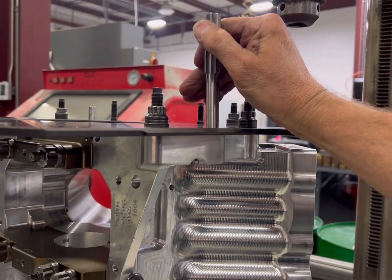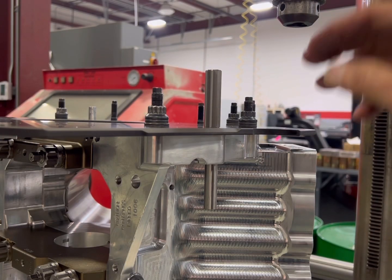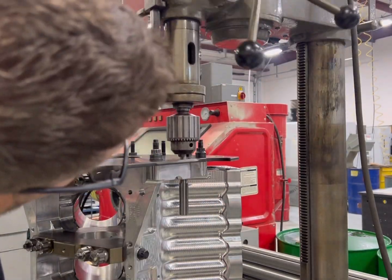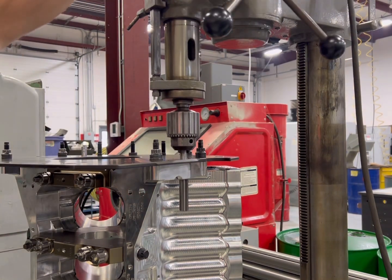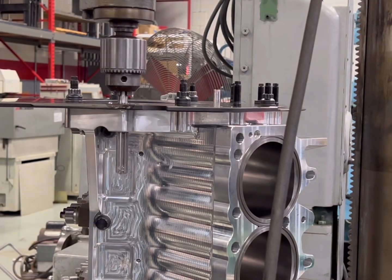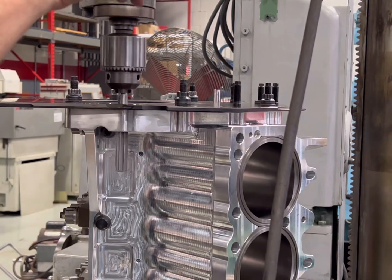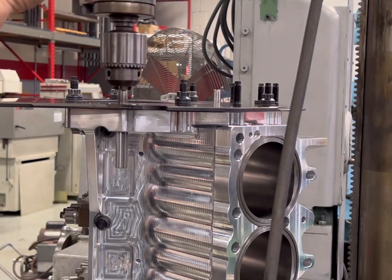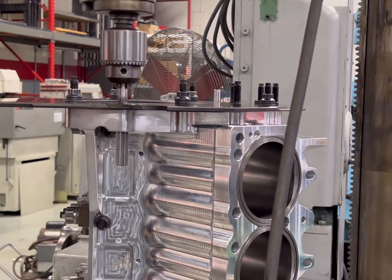You can kind of see what's happening here — it's using the hole in the motor plate as the guide. I'm going to align everything back up and pull this reamer back up through the welded area where that alignment hole is, and ream that hole from the back side. What I'm using here is a Winona valve seat machine. I'm going to take my time — you only get to do this once. Well, you could weld it back up and try again, but I want to do it one time, because that's how I roll.